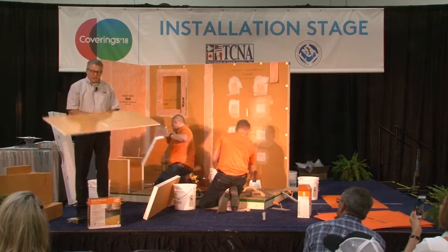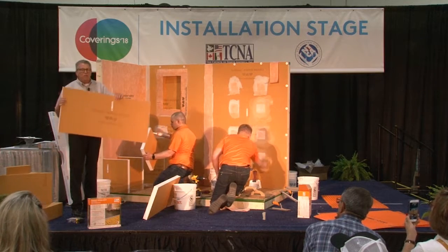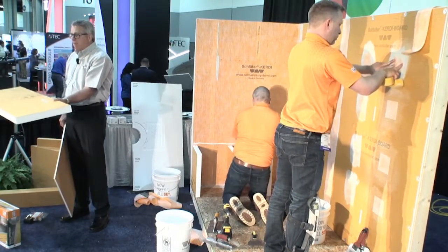This is going to be the face. This is our 1/2-inch board, just like we're using on the walls. At that block spacing, that's going to be plenty stiff, plenty thick enough to do the face. And then the top, we're back to our 2-inch board here. That's been pre-cut, ready to be the bench top.